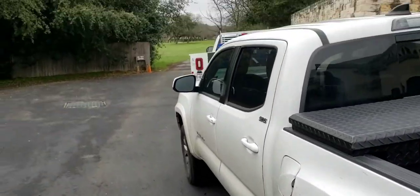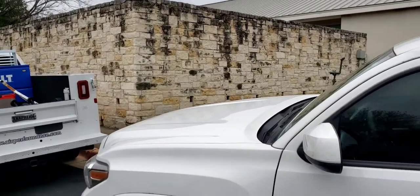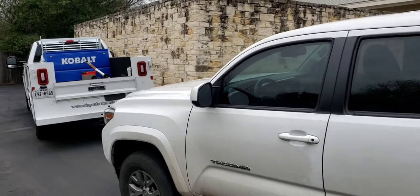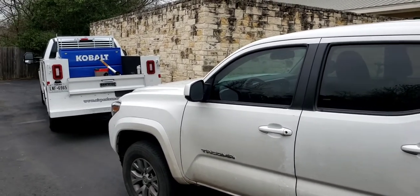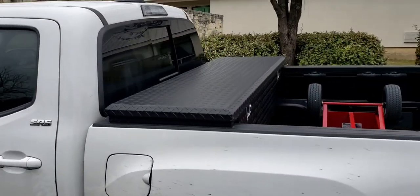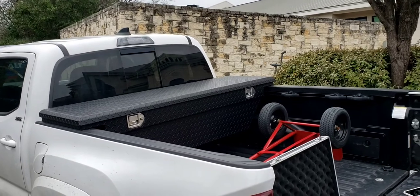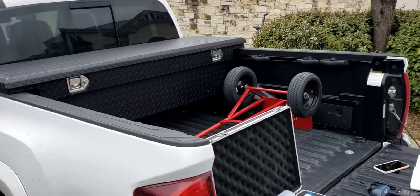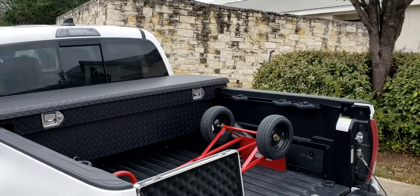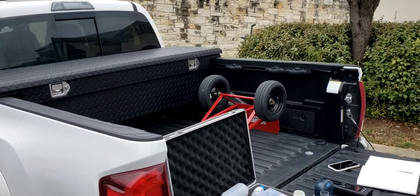So what we've got going here is an air-cooled York inside that enclosure there. I think this one's about 20 years old, having all kinds of issues — it's had several compressor changes. Right now I've got a really high evaporator approach of 10 degrees. This is a new account for me — we just picked it up. It's our first time here today. We've been working on some of the automation; another company's had the mechanical. I've got a starter coil that's out, crankcase heaters out, and the pumps were really wacky on the balancing. It's just been one thing after another.